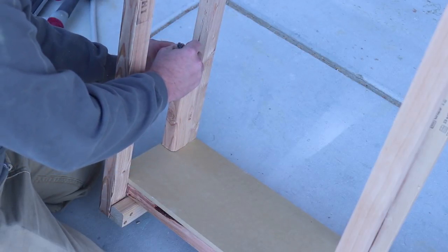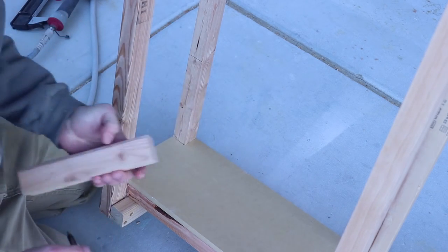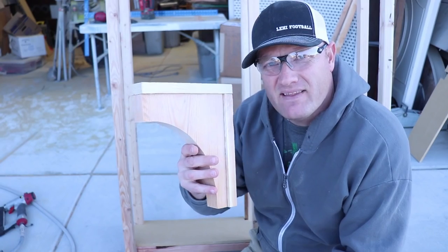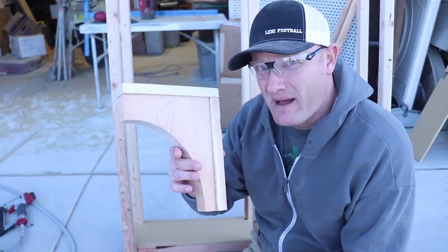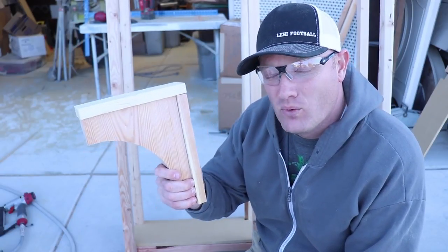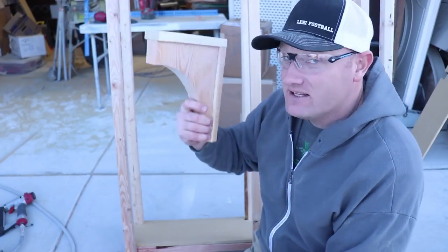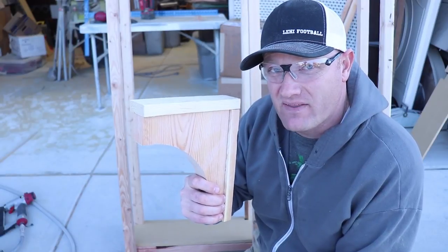That fits pretty nice and tight. I want nine inches between the shelves — I've measured this out and cut a board to nine inches so that all my support braces are right where I need them to be. I've had these corbels kicking around for about a year from a table build where I made double what I needed. I've got 12 of them and I'm going to use six up each side, so six of the shelves will have these on there.